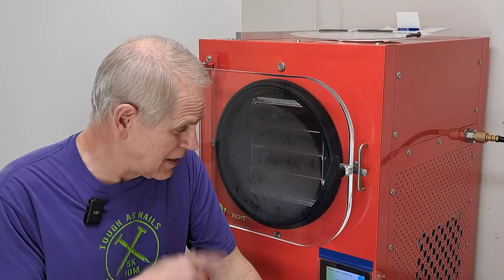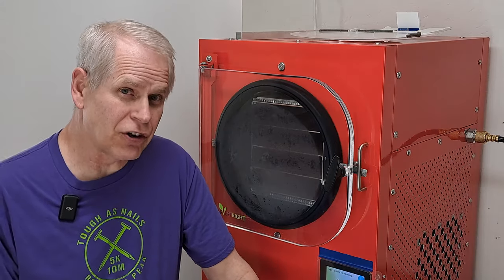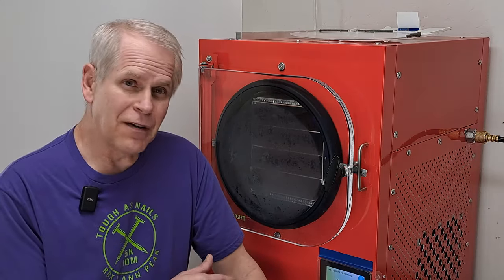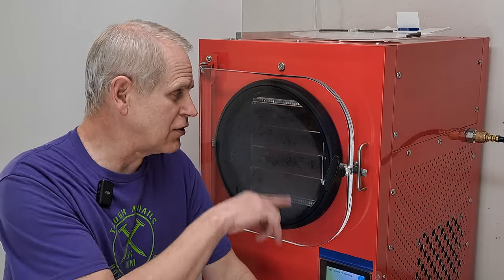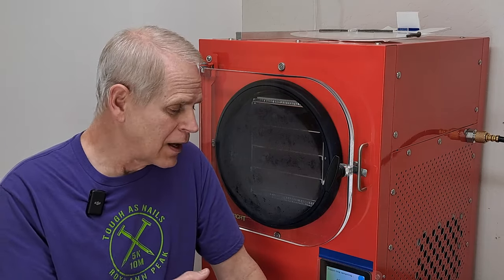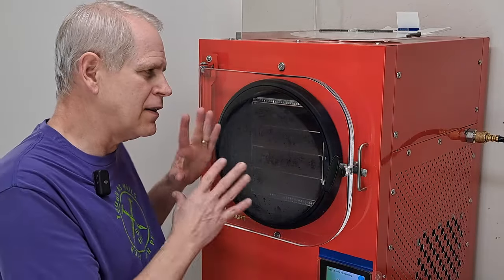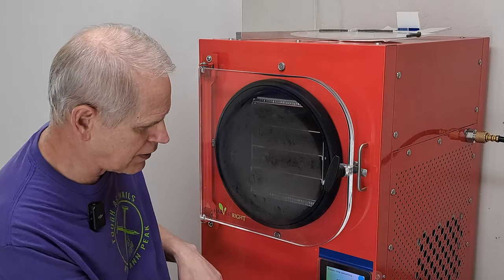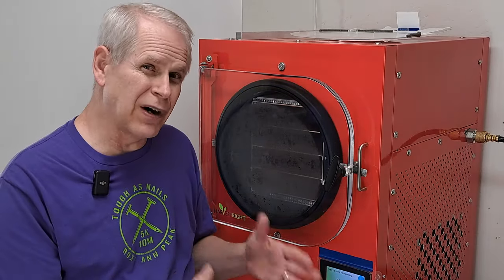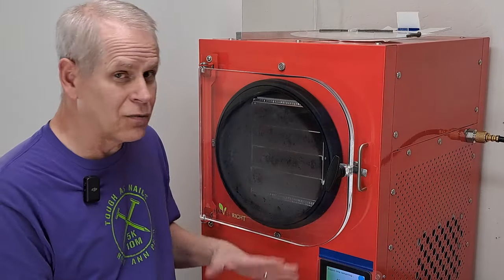I'm finally back. It's been freezing now for just over three and a half hours. For this kind of batch it doesn't need three and a half hours — it just needs enough to get that chamber wall all the way cold, which to me is a minimum of negative 40 below zero, and I can tell that by having the thermometer touch the barrel. On my software I can trust the tray temperature to an extent after a while if there's nothing in there.